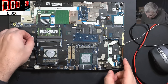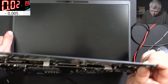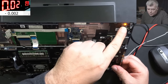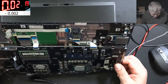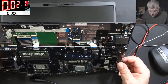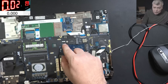Let's try to plug the charger again and press the power button. Now it's making sense — we have the light here, just like the customer said. The customer forgot to connect the power button ribbon cable. You can see the EC chip is responding, which for me looks like a BIOS issue. So what I'm going to do is check the BIOS chip — I believe this one is the BIOS chip.